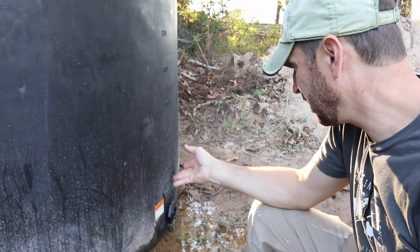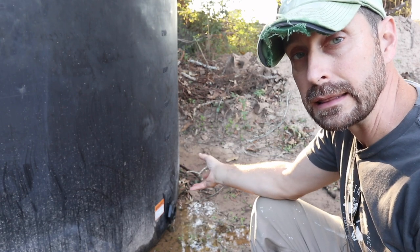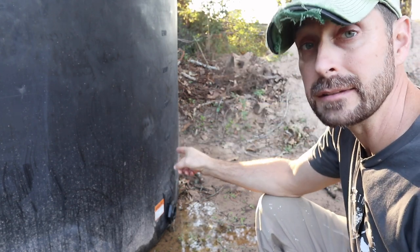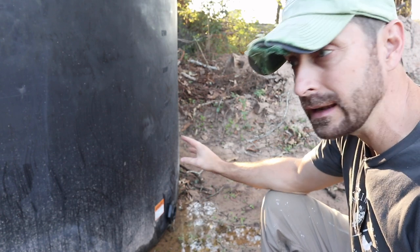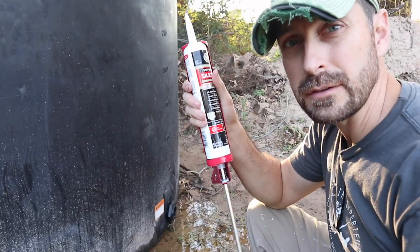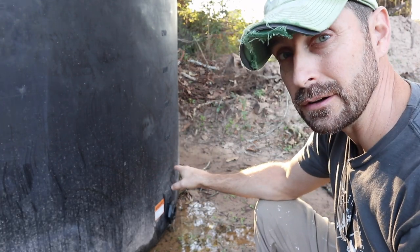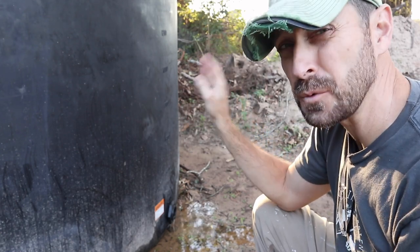The garden's a little different. Luckily, we're still on our well and the community well and not relying on this solely right now. Now that our water is almost all drained, remember: your bulkheads will come from the inside — the seal is on the inside and the nut goes on the outside of the tank. Something you can do to help with any potential leaks is put some silicone just underneath the nut as a secondary seal. The seal inside is the most important and should be working, but if it's not, you want a little bit of backup.